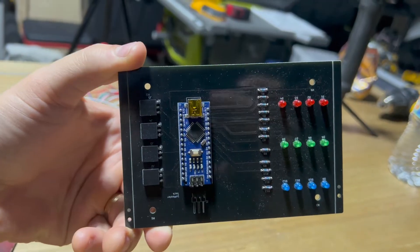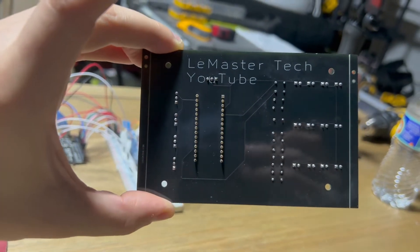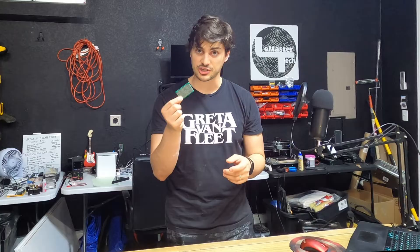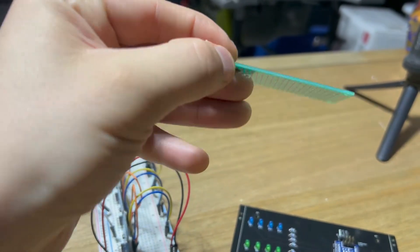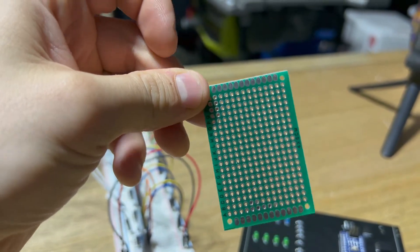This is where turning an application into a printed circuit board is an extremely powerful option. The simplest and fastest way to go from a microcontroller and a breadboard circuit to a rigid board is with one of these — a prototyping printed circuit board. It's basically just a breadboard where you solder the components in place rather than just sticking them in. The only difference is you technically do have a pretty rigid, more or less complete circuit when you're done soldering.